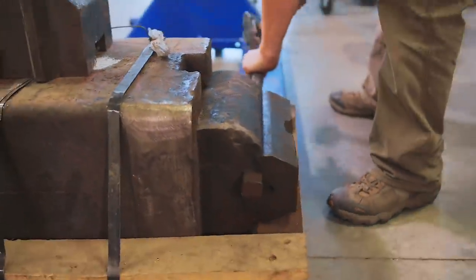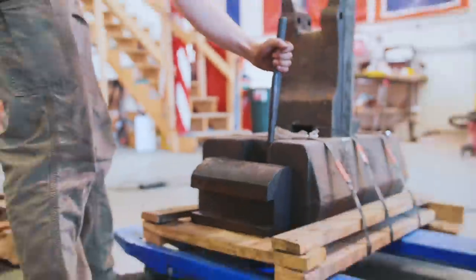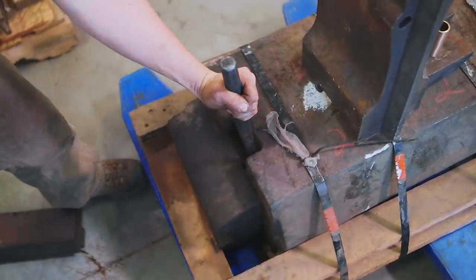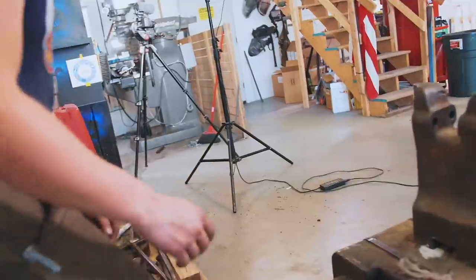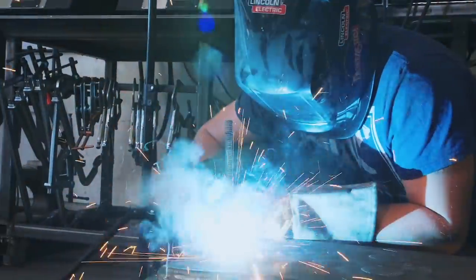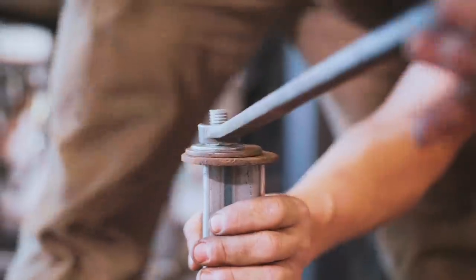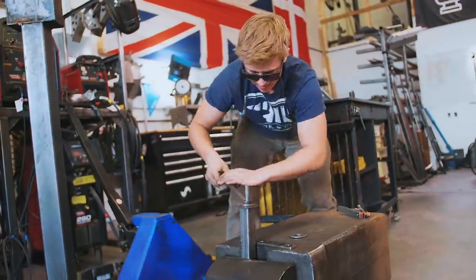The dies and sow block are held on with tapered dovetails and keys. This means, after decades of standing still, they can be quite a trouble to get unstuck. That's just not moving. Oh, why don't we cut it off and then use the impact driver?